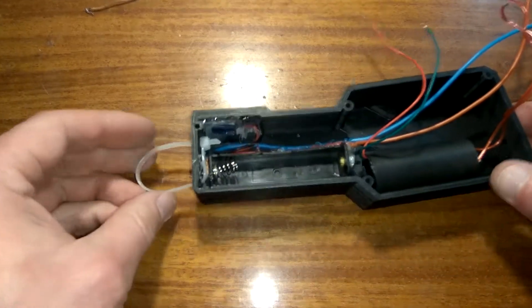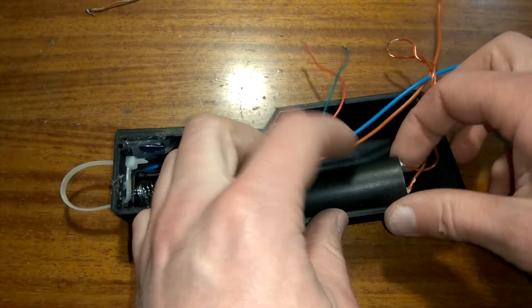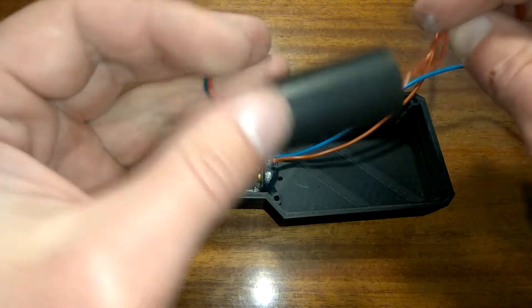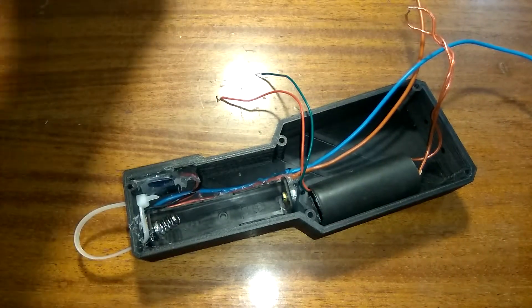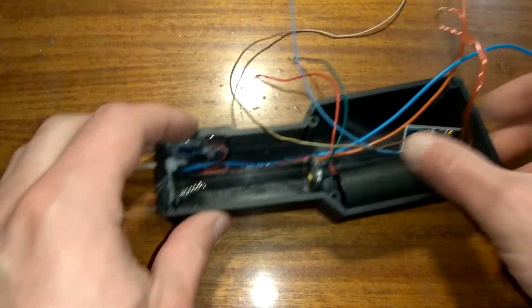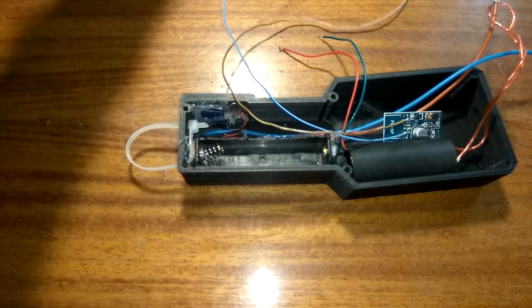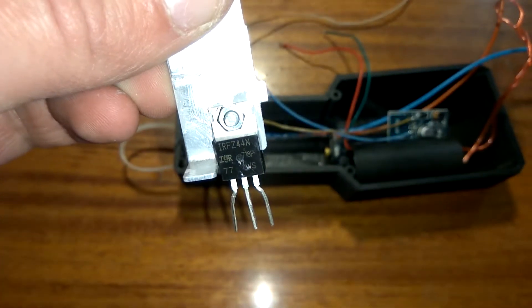To get some sparks I will be using a cheap high voltage module that you can find on AliExpress. Most of them cost under 5 bucks, and the cheap ones under 2 bucks I'm sure will work just fine. Now I just need to slap everything together. In addition to the battery holder and charger, I will add this high voltage module, a boost converter to pull up the gate of an N-channel MOSFET like the IRFZ-44N to 5V, and a button.